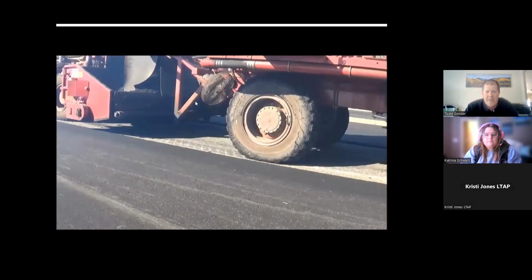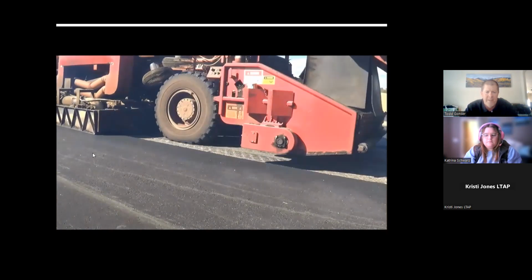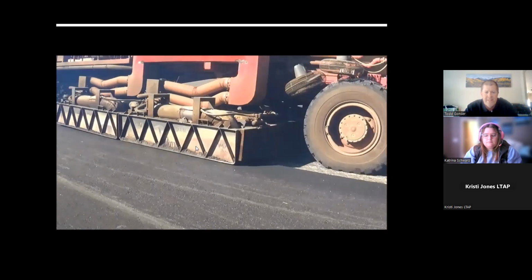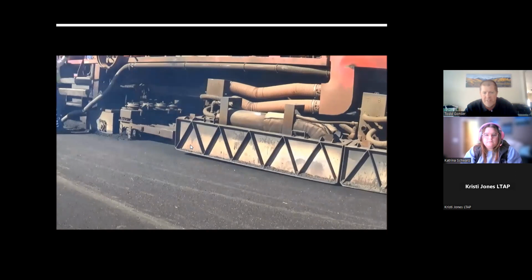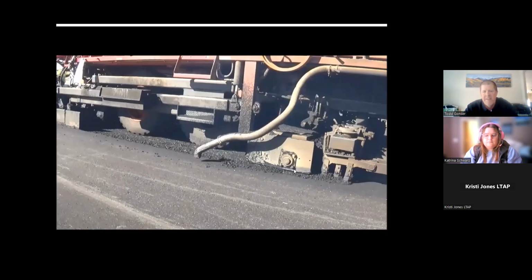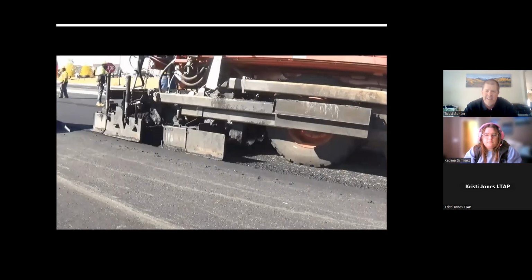So that new mix from the truck is getting deposited in the repaver hopper right here. And again, that's going to go all the way up and over the top and to the back paving screed. Here's the finishing touches for the rest of the heating. Here are those carbide tip teeth coming through not only the adjacent lane by about 6 inches to a foot, but also that existing lane. That mold board and counterflow augers are gathering up all that material. It gets rejuvenating agent applied, and then it's laid down by this recycle screed.